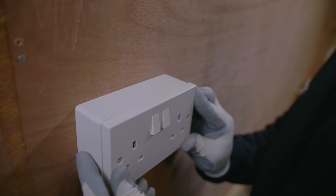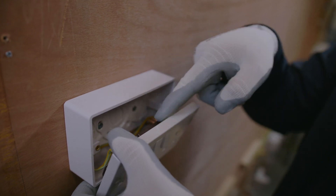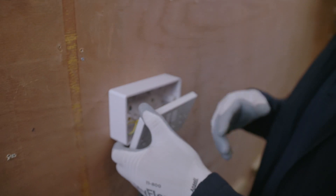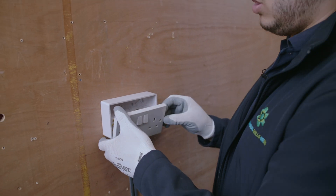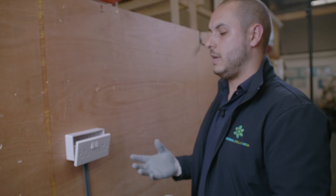But in this case it's a bit too tight, so that might give you problems when trying to push that back up. And as you can see it takes a bit of pressure to get it back up, which is obviously not great — and when you come to inspect it you can't. So we need to look at how we're going to get past this and what we can use to relieve the pressure on the cables and make for a better job.